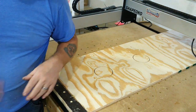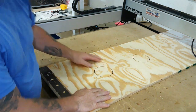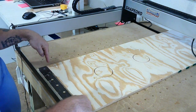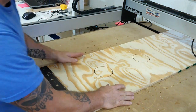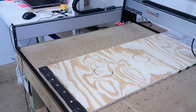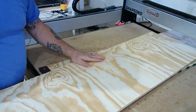It's a good opportunity for me to explain how I did it. This is the piece I ruined. I've drawn it forward to my fence so that I know it's not cattywampus — straight — and I've drilled pin nails in here, here, and back into here. So now I know that this thing isn't twisted.